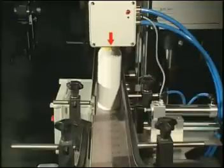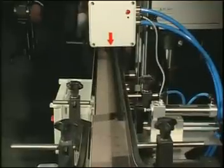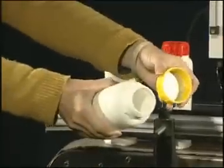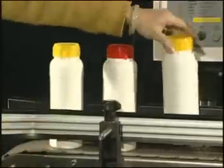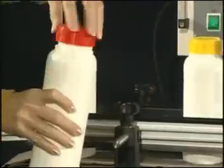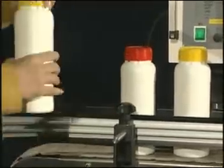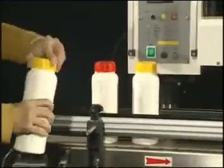The highest relative conveyor speed can reach up to 60 meters per minute. When caps without aluminum foil pass through the foil detector along the production line, the detector will detect them and give an automatic warning siren, and reject devices will then reject them. The aluminum foil cap is recommended to avoid contamination as recommended by the FDA.